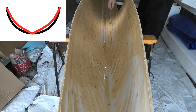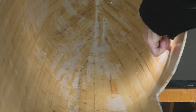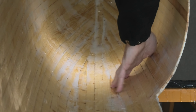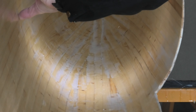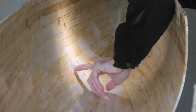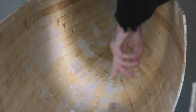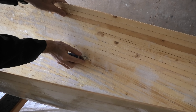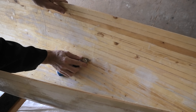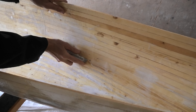Here I've got a small bubble — perhaps I stretched the cloth in the hull band. Here is another one in the inside band. Bubbles are easily formed if the cloth is laid too short and won't follow the bend. Another reason for bubbles can be trapped air, for example between strips or in staple holes that aren't filled enough. This could be a result of my water experiment last time if I had surface water still left.